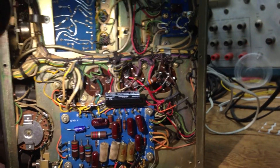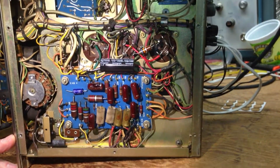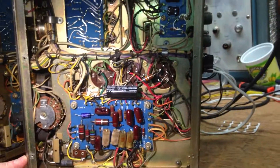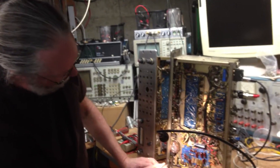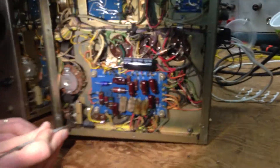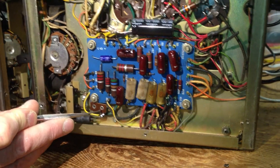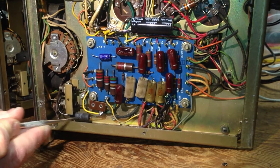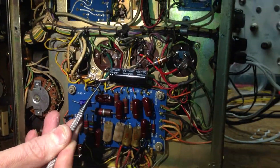It seemed a waste to spend $40 on a cap and only use half of it. The filament supply — the 12-volt supply doing the signal — was too high. With one output module and the pair of triodes for the record amp removed, that requires a 2-ohm dropping resistor straight off the rectifier diodes for the heater supply. There's an extra terminal strip tacked on the side — it comes from the rectifier through the dropping resistor, then into the wire going to the first capacitor.